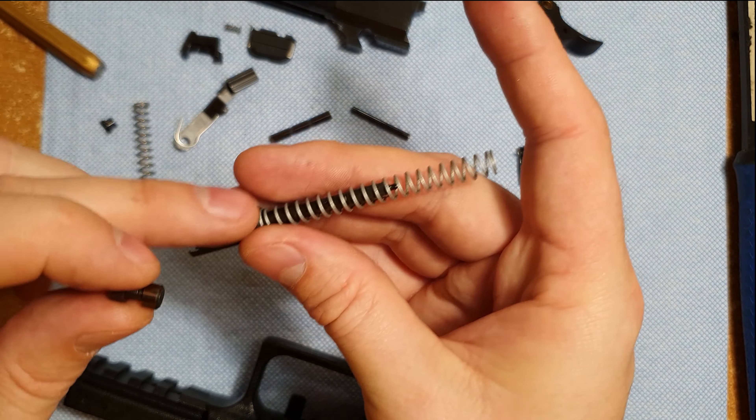These grips are supposed to come off — I can feel it's a little bit loose — but I can't figure out how to pull this bit out, so I'm not going to be able to pull it out. We're going to take our sear block. If you want to make a nicer trigger pull, this is one of the areas you might need to polish or just grease it. We're going to take that lip there, engage it with the back, and then rotate it into place. Next we're going to get that trigger bar — this flat end has to go in that slot, so I've got to wiggle it in there, and it also has to clear the front post at the same time.